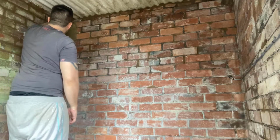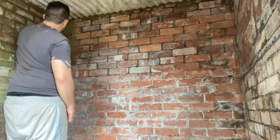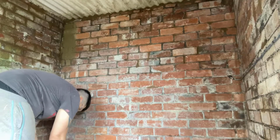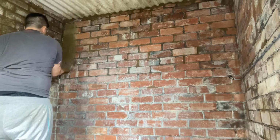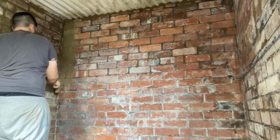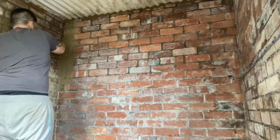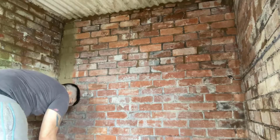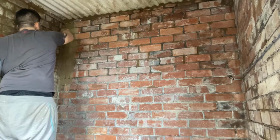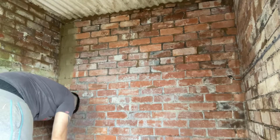And then putting it on the walls is very simple. I mean, you can just apply it as you would with any type of paint. It's quite easy to work with, as long as you don't put too little water in. If it is too stiff, it can be a little bit harder to spread. And obviously, as soon as you've added the water, the chemical process does start. So as you're working your way through the bucket, you can actually feel the slurry stiffening up. So yeah, I would rather have it a little wetter than a little drier, if it was me doing it.